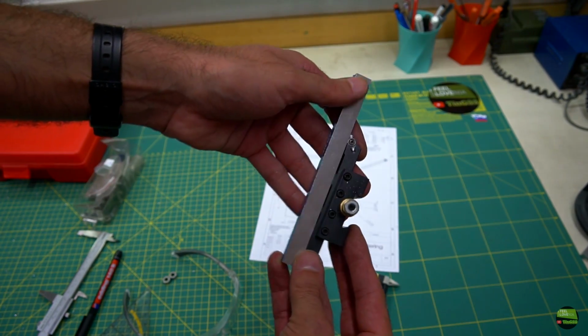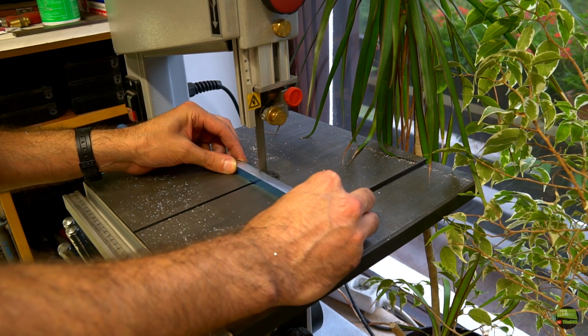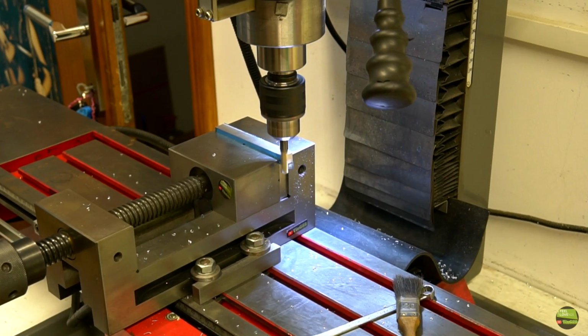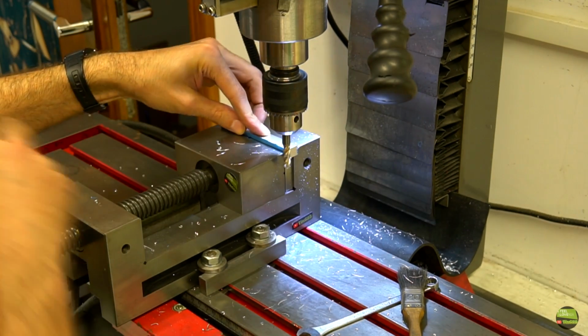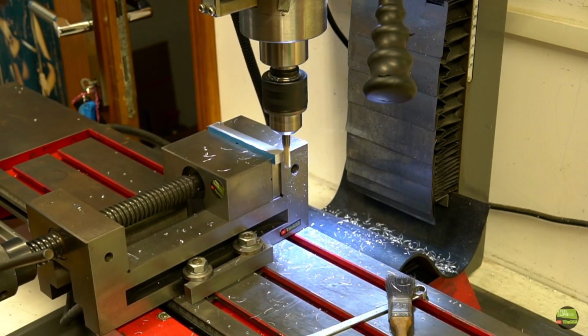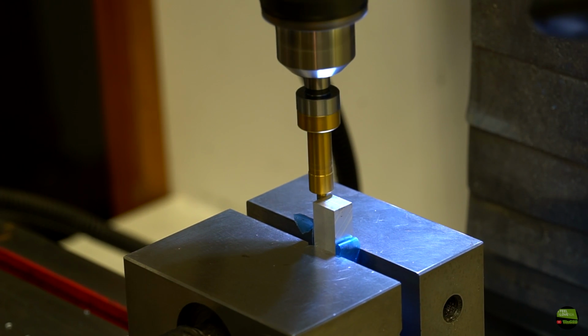But if I compare with the cutting tool, I think 100mm will be a better dimension. Problem solved. Now clamp it to the mill and cut both ends to get a nice surface all around. Clamp the workpiece into the mill upright and find the center. Then make the groove for the bearing.